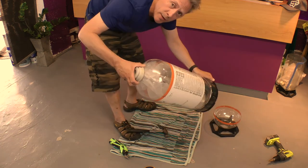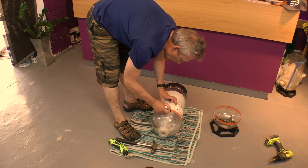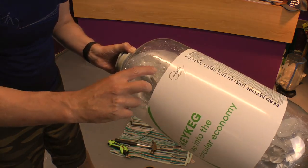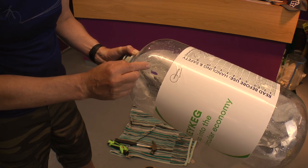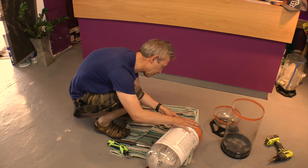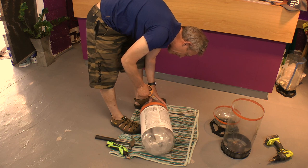We now pull the inner one out. Actually, before I do that let me just make another marker line here. So that's the outer piece done — I'll put this to the side. There are the two holes and the other holes around. I cut the original one here and that's the outer skin. What I want to do is create a lip for that outer piece, so I'm going to cut here now all the way around about an inch up, then use the scissors gently so we don't deform the plastic, just enough to get the electric scissors in there.